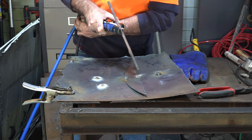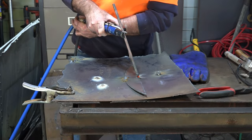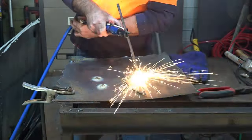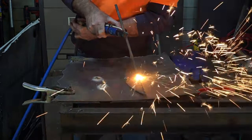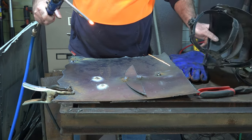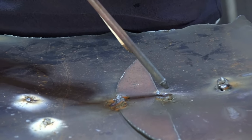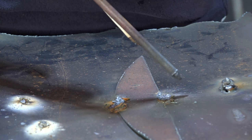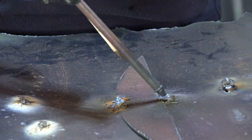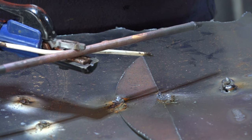Let's try this side. See this guys — it did start to get the weld out of the way a bit, but maybe I'm not using quite enough amperage. I'm only running about 150 amps and this rod is about an 8mm rod, which is probably too big for what I'm doing. Anyway guys, you get the general idea — you can get rid of the welds. So my thoughts are excellent. Like I say, she's just a DIY sort of version, but you've got to start somewhere.